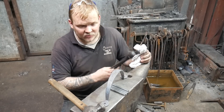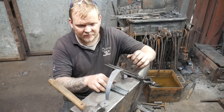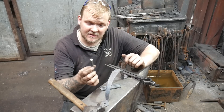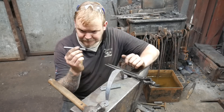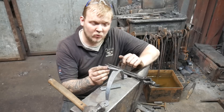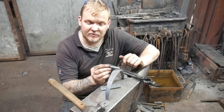That part's made — quite happy with it, it's bigger than I thought it was going to be. I didn't really think about measurements whilst doing this. However, I've cut four pieces of 12mm round bar, 100mm long — that's half-inch round bar, four inches in length. I'm going to now forge the little hooks, and then I'll drill some holes and rivet everything together.